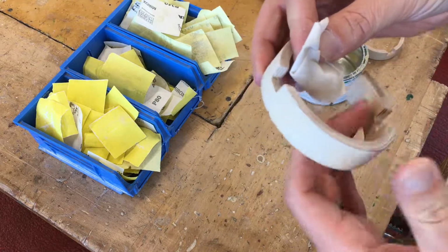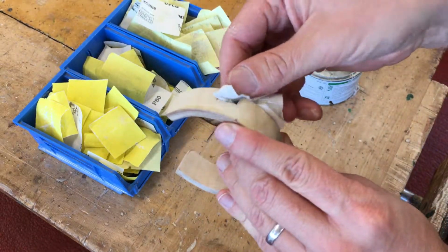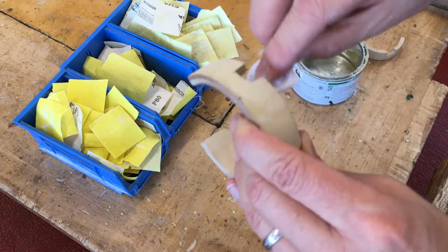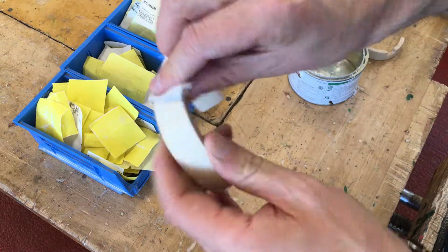As you finish rubbing it in, the moisture that's in that finish will start to seep into the wood, and that wood grain will start to expand with the moisture. So that smooth finish you sanded it to earlier won't be as smooth.